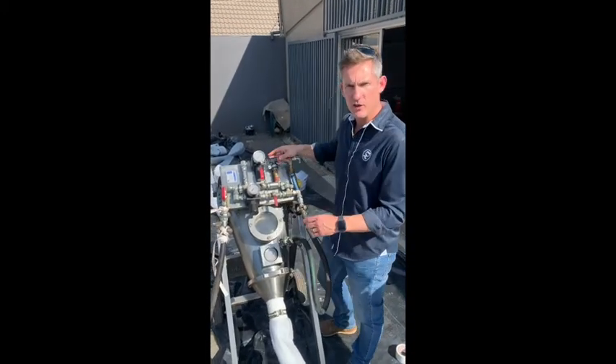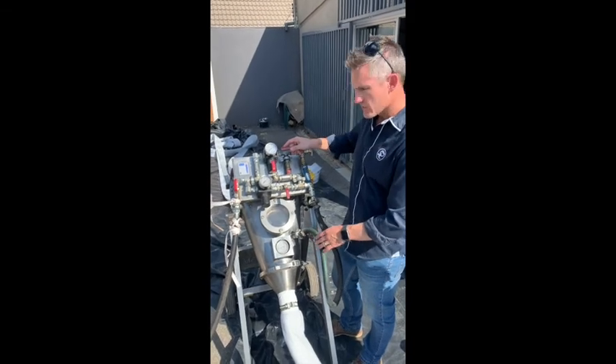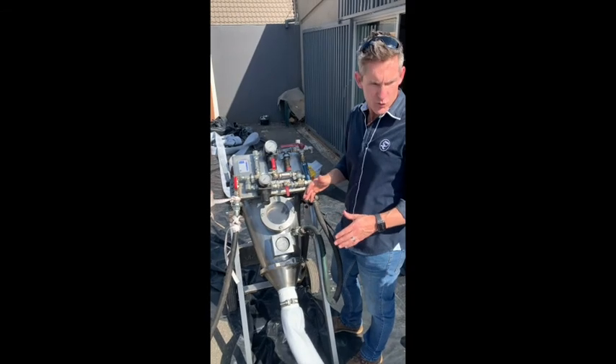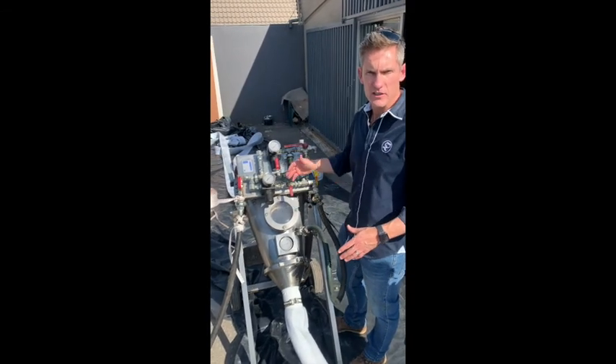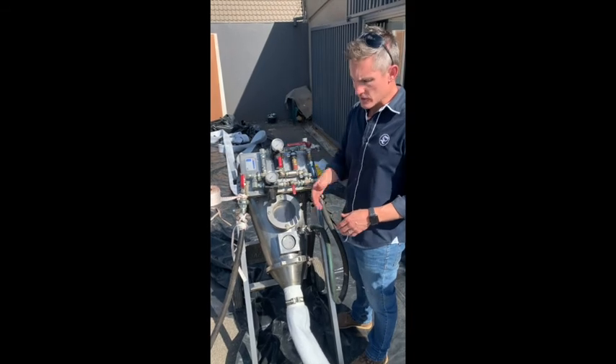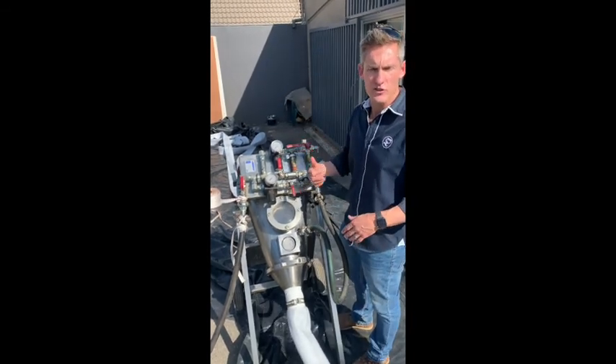Garrick, please can you send this to Peter and ask him to give us a hand here. So the problem that we're getting is that when we're blowing the liners in, at about 14 meters it's getting stuck, it doesn't go any more, and it's on a straight line, DN100, and it's bouncing back — we can't get it to actually stop.